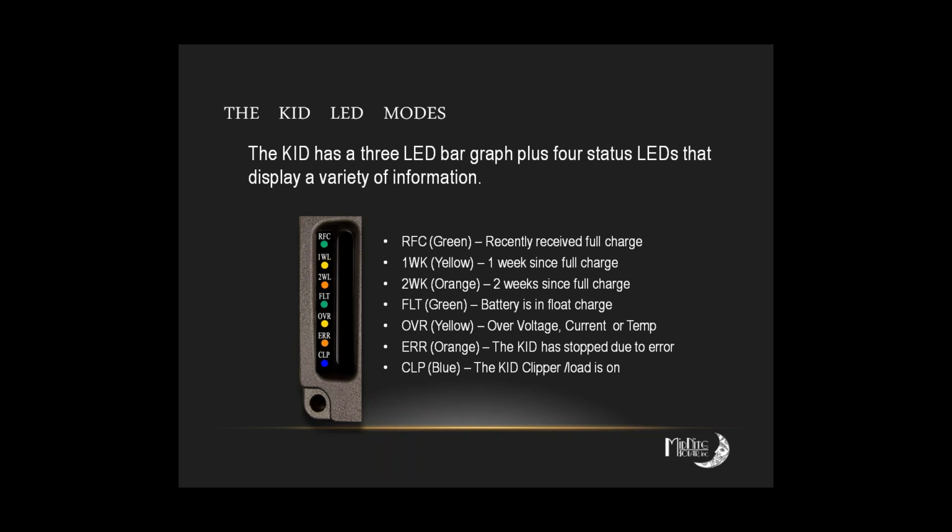Well, no, usually it's current. I mean, this is a 30 amp charge controller and 30 amp on the output side. So if you've got the potential of generating 31, 32, 33 amps under perfect conditions into the batteries, it's not going to allow any more than 30. And while it's doing that full 30, it's going to be showing you the OVR light occasionally because it's letting you know that it's clipping, that there's more current there than it can process, and it's not allowing it through.